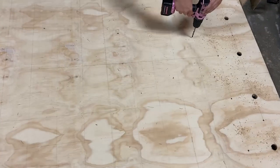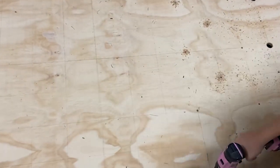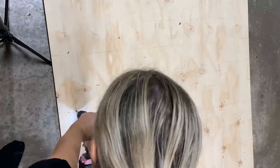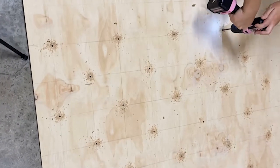After creating your grid, you can go back in and do your drilling. Me and my husband divided it up — he drilled the large one-inch holes and I drilled the smaller ones. I recommend before you drill any holes, go to Lowe's and pick out your dowels first. I grabbed one-inch dowels for the larger ones and a smaller dowel size for the smaller holes. Test them so you can put the dowel in and make sure it's going to work, because the worst thing that could happen is you drill your holes and the dowels don't fit. So I went through with a small drill at every other grid intersection, drilled a hole completely through the boards, and then my husband did every other one. We did that process for all three boards — this is the part that took a while.